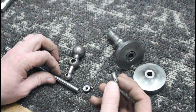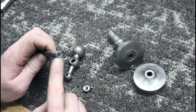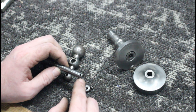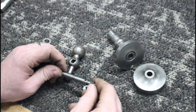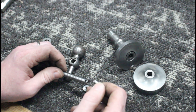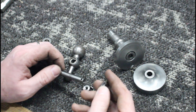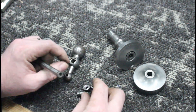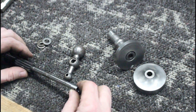What I'm going to do is cut a little stub. I'm going to stick this in the lathe with a mill, mill that out, and hopefully get it pretty concentric. We'll get a new piece in there, press it in, stick the pin in there, and then thread it 12-24. We'll probably also cut a new slot because we need that little pin that fits in there, and we should be good to go.